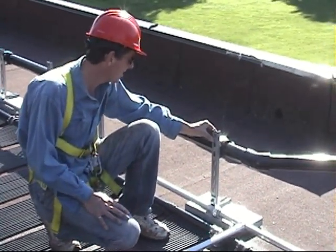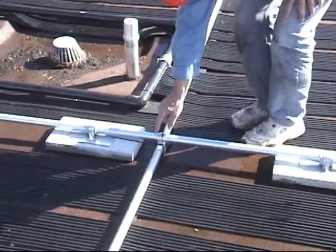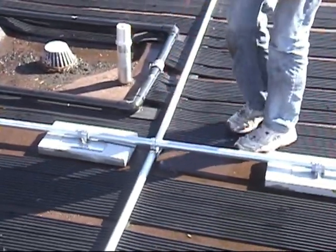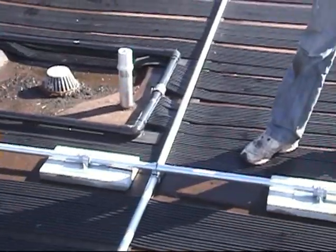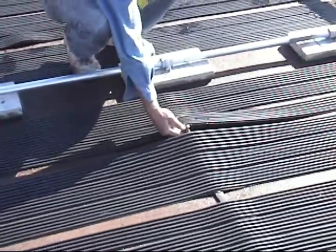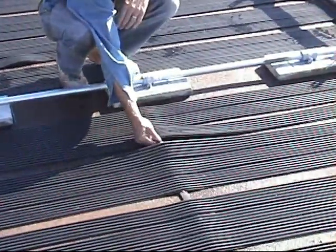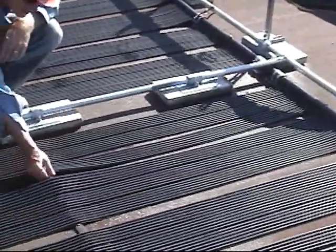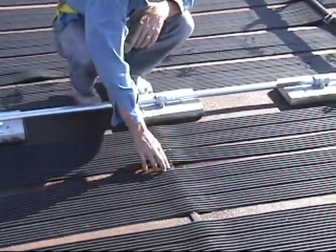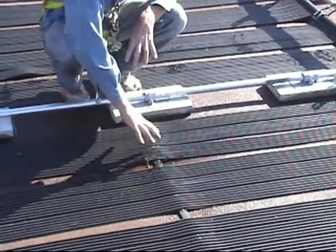Unistrut P4100, pre-galvanized. The cross connections in the middle are done with hose clamps and an electrical conduit clamp. We've run a glue strip every 5 or 6 feet — the bar spacings are about 10 feet. We've used a 2-tube-wide strip and run it underneath, glued with mastic to the panel, and that just keeps everything from scattering around in the wind.